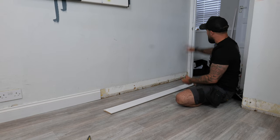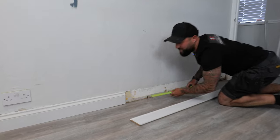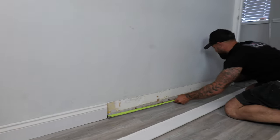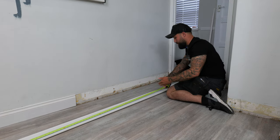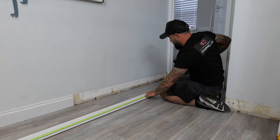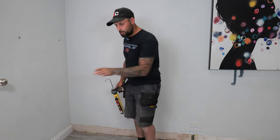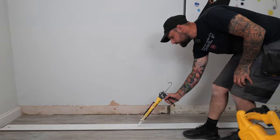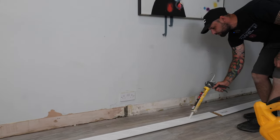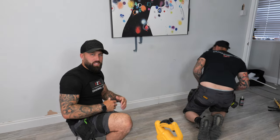Phil's cut the two metres. Now it's time to measure the gap — it terminates on that door frame, so it's a single measurement to the furthest point on the mitre at the bottom. We mark that onto our board, hook it over the edge, and take it to the saw for a straight cut. We've got our two pieces — same process as the pipe wall. We stick the first one on with grab adhesive, wallop. Then we stick the second one into place and mitre bond the joint. Line up the mitre, hammer some pins in, and let the adhesive go off.